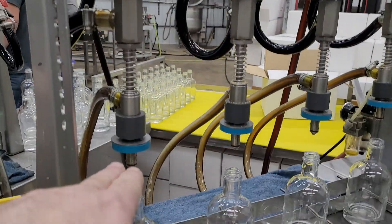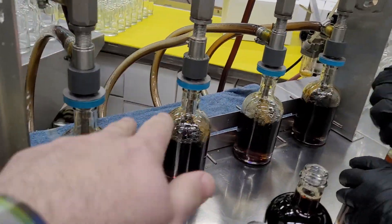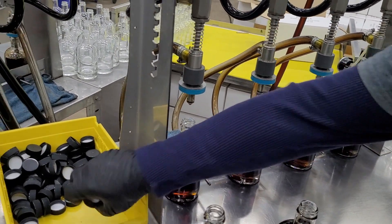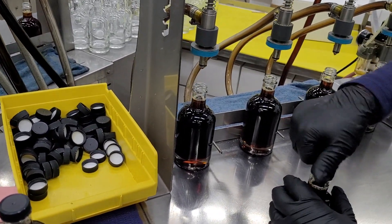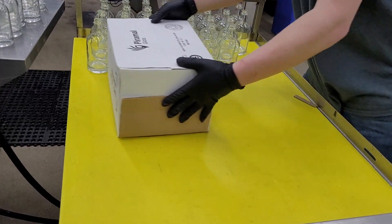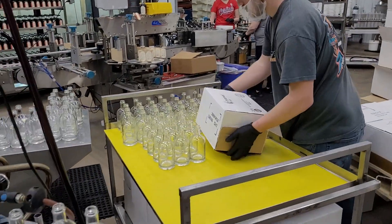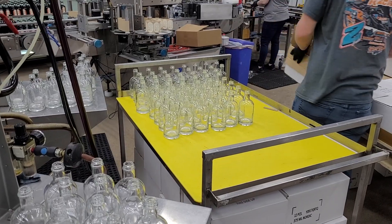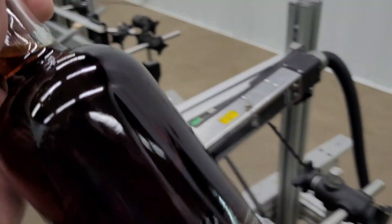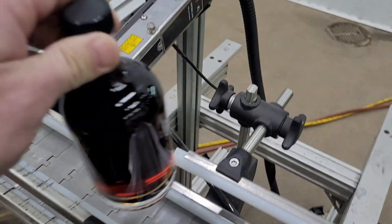When those depress on the bottles, it opens the valve, and that little head pressure in that pipe is just enough that it'll go down in these bottles as opposed to going back. We want to fill these glass bottles. This is the spicy maple syrup. Kyle's dumping glass and keeping both parties filled. This is the ink jetter - we put a bottle on here and it puts a lot code on there. It's hard to see with dark syrup, but there it is. Got a lot code and a date-time stamp. We'll follow these bottles down.